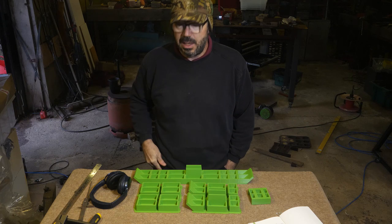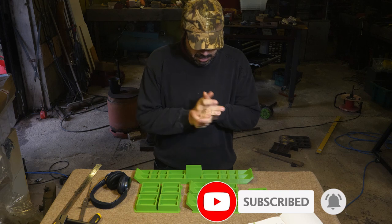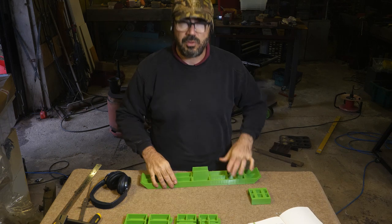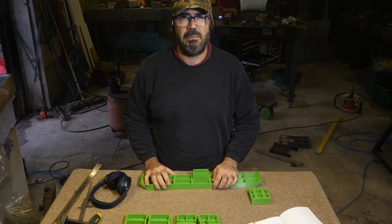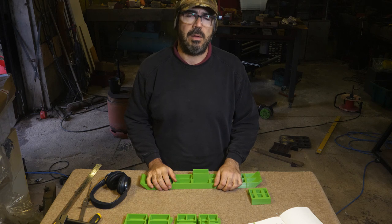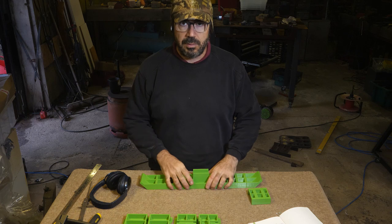Hi guys, it is freezing. Right, I'm gonna try and cast this. I've also bought some more green sand and I've just opened it and it's not at all sticky. I assumed it would have bentonite. I've never bought ready-made green sand before. Maybe that isn't a thing and I'm gonna have to add bentonite. Anyway, it's kind of disappointing because I wanted to just get on with this rather than sort my sand out first.